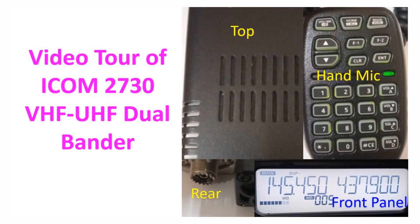Coming to my second innings in ham radio in 2023, after a gap of a decade in between, my Wacon tube radio is untraceable. I now have two commercial radios: one VHF-only TM261 base station and another brand new IC2730 VHF/UHF base station. I am using 50 ohm HLF200 cable, which is supposed to be a clone of LMR200 cable, and I get an SWR of 1.1:1 on VHF for my commercial CP22E VHF antenna.